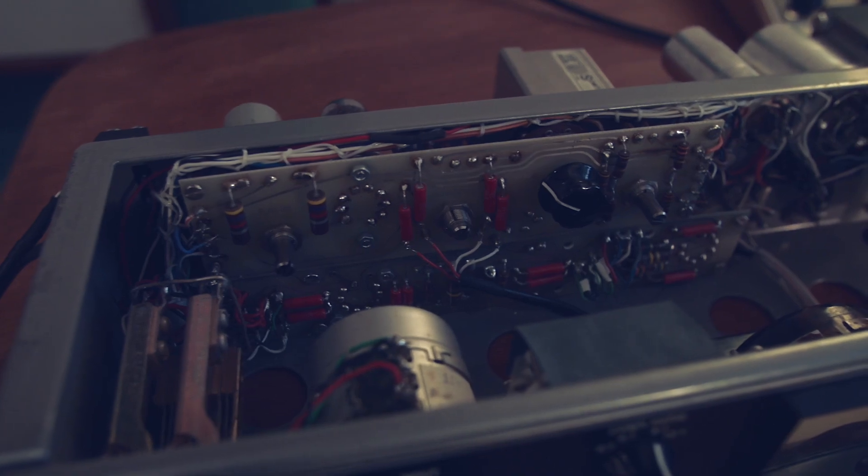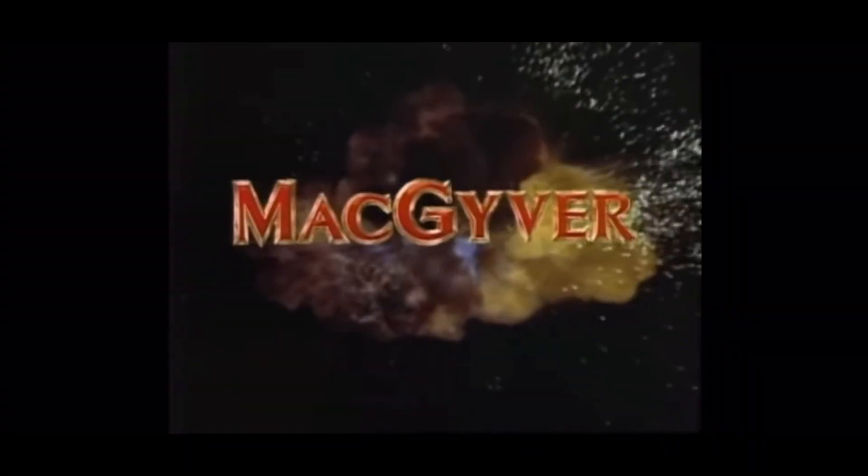To fix the meter switch without altering the front panel — one of the beauties of DIY — I replaced the part behind the output vernier control knob with a push-pull pot. In its regular position it shows gain reduction, but if I pull the knob, the meter shows output levels. I added another modification similarly. There's a jumper on the 176 main board to set the input to low gain or high gain — in high gain the 176 has 10 dB more input gain, allowing you to drive the signal against the threshold 10 dB earlier. In real life, no one would reach inside during a session with a soldering iron just to change this. So I replaced the part behind the input vernier with a push-pull pot — in regular position it's low gain, pull the knob for high gain. Both modifications don't alter the looks or original circuit; they only make what's already there more accessible.